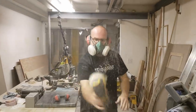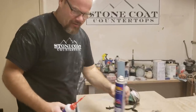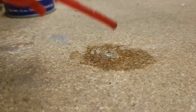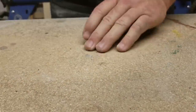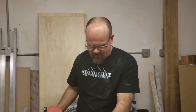Turning my speed down gives me better control on those bullnose front edges. We have a screw hole in the surface. We're going to use our 2P10 glue and accelerator to quickly overfill that and then sand it flush. When filling a pit or a hole with 2P10 glue and accelerator, you'll want to do multiple passes. If I try to fill a deep hole all at once, it may not dry all the way in there — just do it layer by layer. Our 2P10 glue sets up very fast; you can start sanding right away. It literally took less than a minute to fill and sand. Now we're ready to do our paint primer in one.